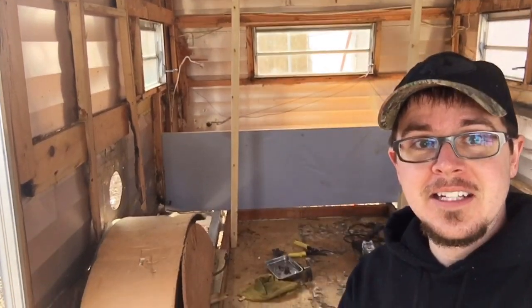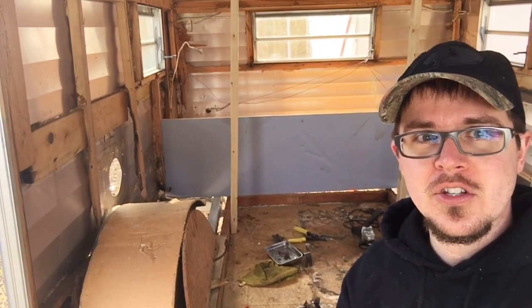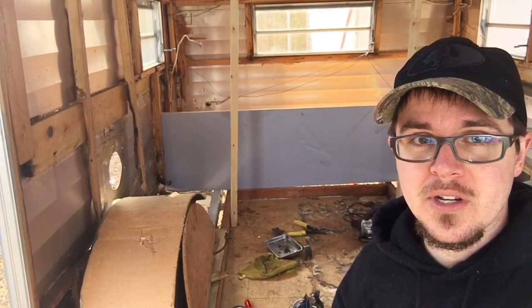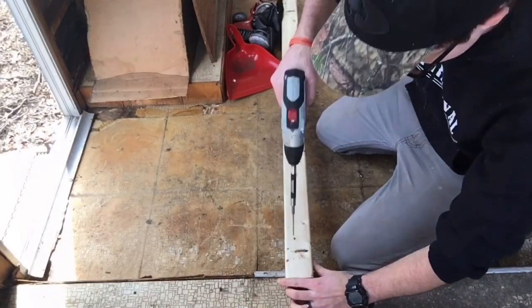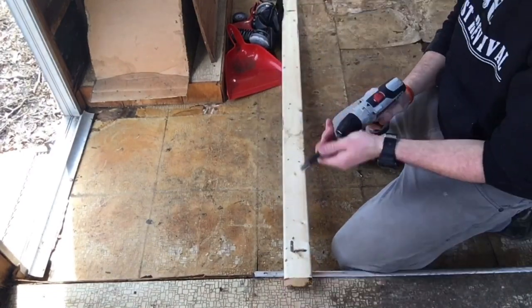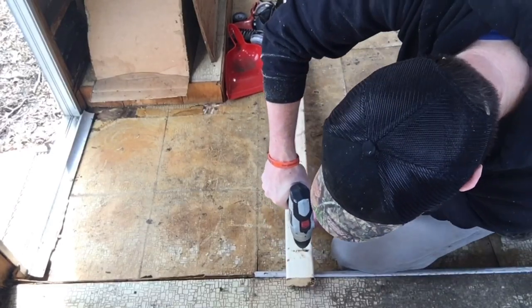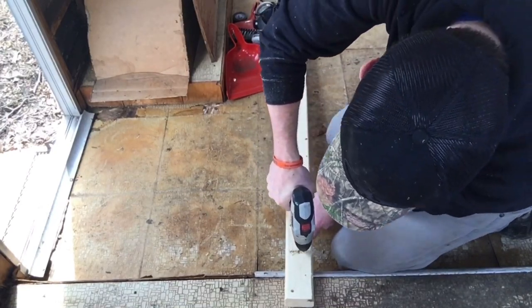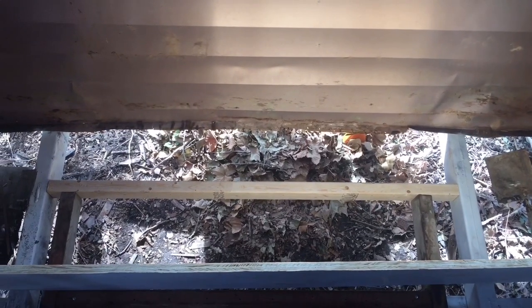All right, so I laid down that floorboard, but when I went to step on it, it was a little bit flimsy. So there's a spot in the floor right there that I'm gonna put a little more framing, just a 2x3 that'll go across. That'll give it a little bit more support. Yeah, let's do that now. Floor stabilized right there. I love you, Emerson.